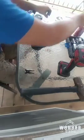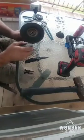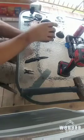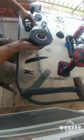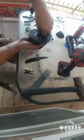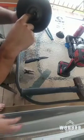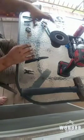Keep all your parts separated. Get the snap ring out - this piece holds your thrust washer in place. Take your shaft, shove it in from the back and push it out. Be very careful because you want to see how everything goes together. There's your thrust washer, another washer, and now you get to where your journal bearings are with your other snap ring. This is why you need a good set of snap ring pliers - you have really tiny snap rings on both sides that hold the journal bearings in.